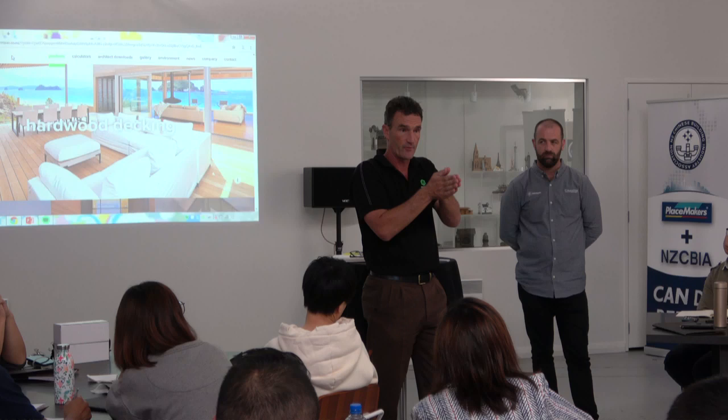This board here is a vertical grain board. So the vertical grain is sitting straight up and down, and if it wants to move, it has to pull itself apart to be able to move. It makes it really, really stable.